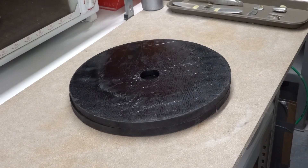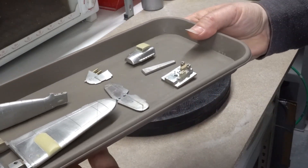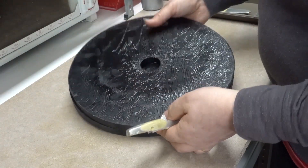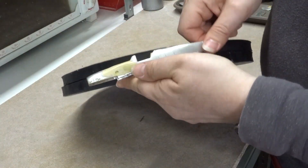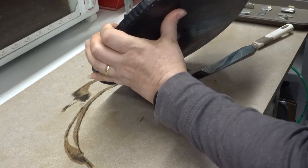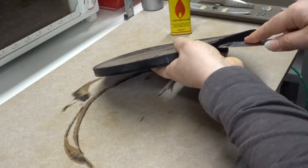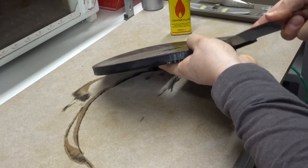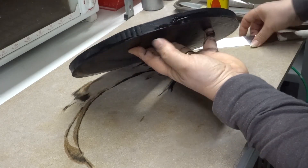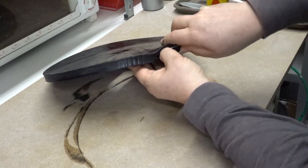While the 9 inch mold is cooking I'll show you how to make a 12 inch mold. This will be for the BF109K4 fuselage, wing and other parts. You can see that the rubber discs aren't thick enough for the fuselage so I'll have to make a deeper mold. Fortunately there is a way. The rubber discs are made from laminations. These can be separated from a blank disc and added to our discs to thicken the mold. I use lighter fluid and a spatula to separate the rubber. It's a messy job as the solvent significantly softens the rubber.